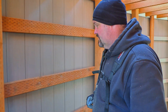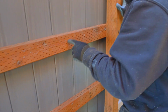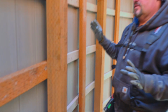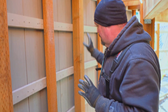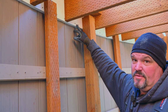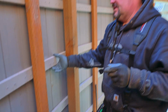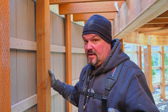Over here, you see we used screws that were short enough so they didn't poke through the 2x4s. But once we started our curve, same concept as the 4x4s, but we have a 1-inch rim joist instead of a 1.5-inch rim joist. So we had to thin out and use thinner pieces, but they're flexible. That's how we got the curve going on this deck.